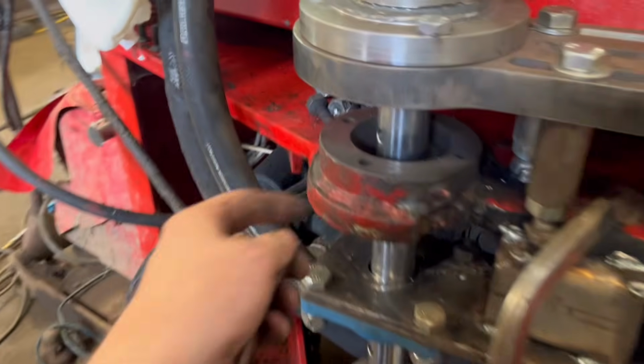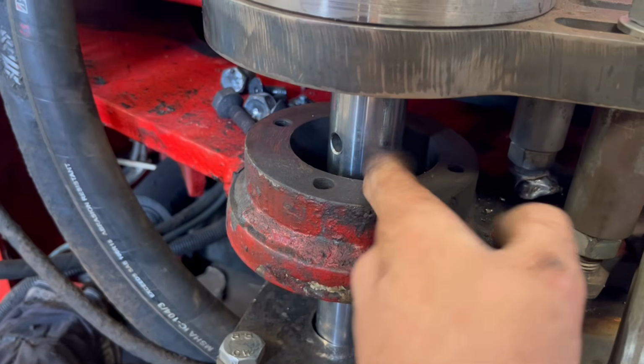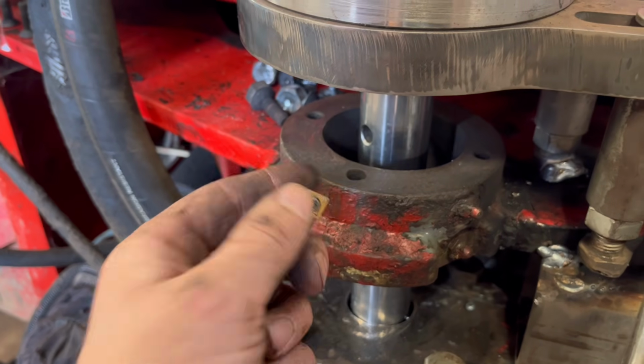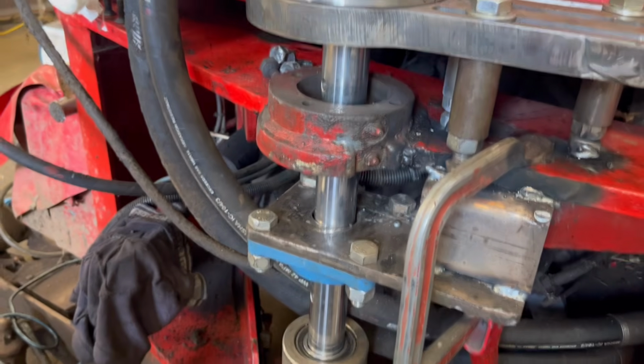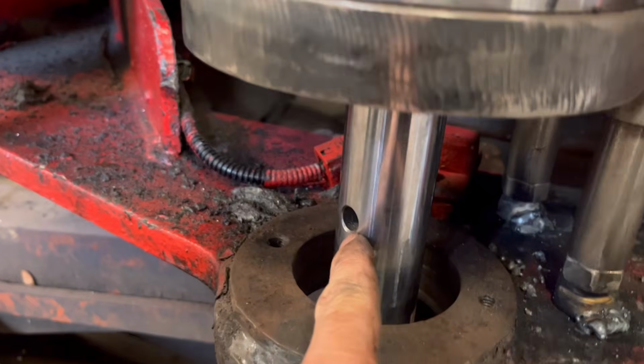So I think what I'm going to do is take the bar back out and re-drill them holes through to 12mm instead of 10mm, and then I can use these bigger tools, because the ones I was using before are just too light duty, they're too delicate. So I'll do that. I'll just drill that one out for this one and that one out for the bottom one.